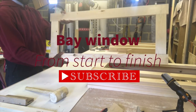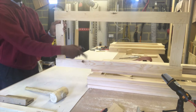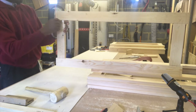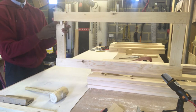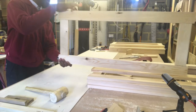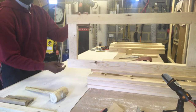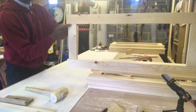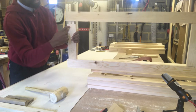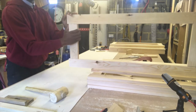Right here I am with a dry fit of one of my shutters. I haven't cut the panel section out yet, but I'm going to cut the inside. Once I've inserted it in position, I glue up the housings for the dominoes — see the holes — squeeze it all up, ensuring it's all square. Then I will put a dowel top and bottom either side of the domino. On this side of the domino I'll place a dowel, drill it through, and on the top that way. Once it's all in position, there's no way — even if the glue goes off — it can pull itself apart.